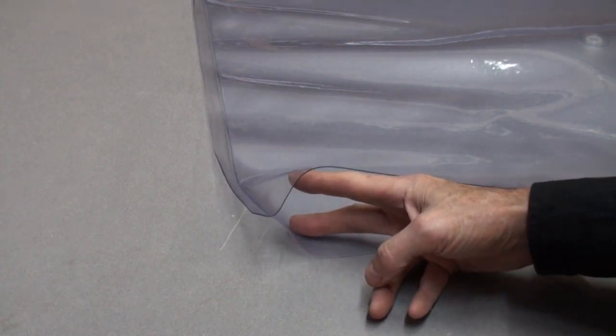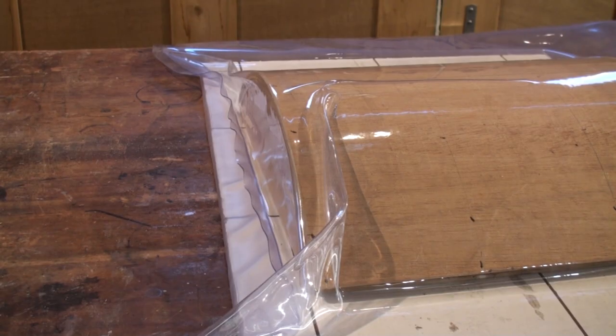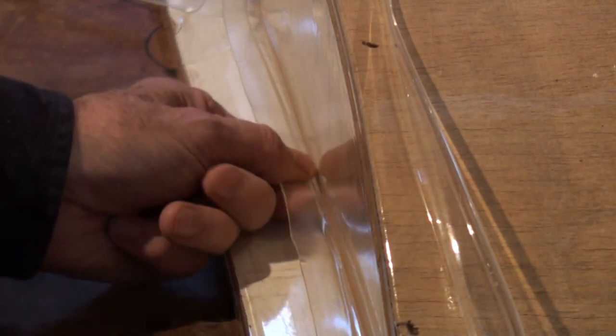There is one additional difference between vinyl and polyurethane — that's about the heat-welded seams. A vacuum bag is generally constructed of two sheets welded together along the edges. Vinyl is inherently weak at this heat weld. Tall, flat, or curved work can put pressure on this heat seam, and when this happens repeatedly over time, the vinyl thins out and tears right along this joint, and can even sometimes peel apart. Polyurethane will never do this, which is why we warranty the seams against this issue.